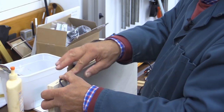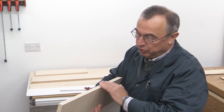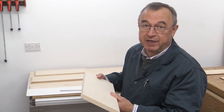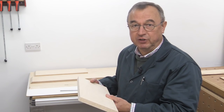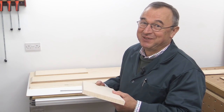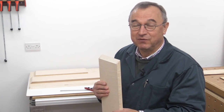I'm going to put a little fillet of wood in there with some glue after the cable's in, just to reinstate the edge. Although I was perfectly happy putting on all the edge veneering and the frame veneering using just clamps and blocks of wood in the workshop, I was a little nervous about attempting the large flat areas of the main panels. So I was very lucky — a friend has a veneer press and he offered to put all the pieces through his veneer press and his rather special sander. I couldn't refuse. And whilst I was there he said, why don't I cut those mitres for you? So we did that on his very big table saw.